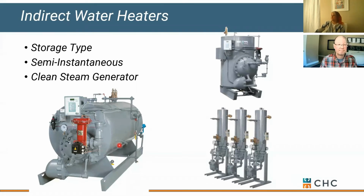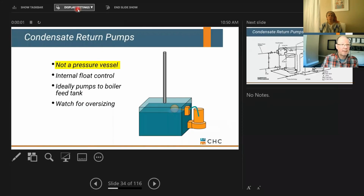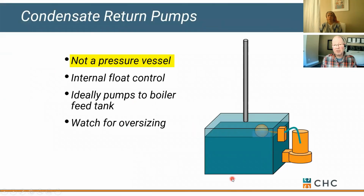Do the condensate pumps have negative suction? I'm going to say no. We do run into vacuum systems where we're generating a vacuum with the condensate return unit. Those run a little differently, in that they are trying to pull a vacuum and get the air out of the system quicker by forcing a vacuum through the traps and speeding the steam distribution through the system. But in general, a condensate return unit is always dealing with a flooded suction. Once this receiver fills up, the pump's flooded with water, so it's not running in a negative situation. I hope that answers the question.